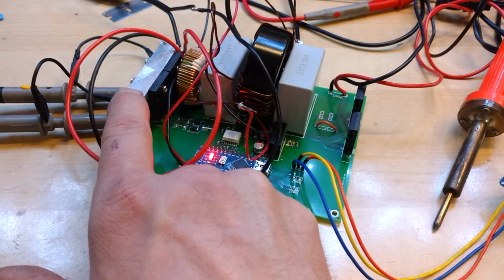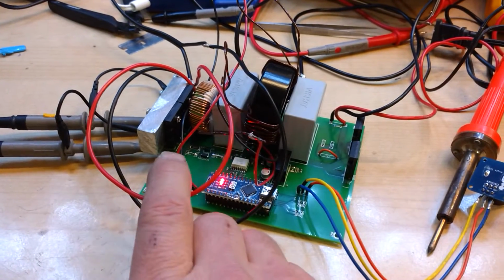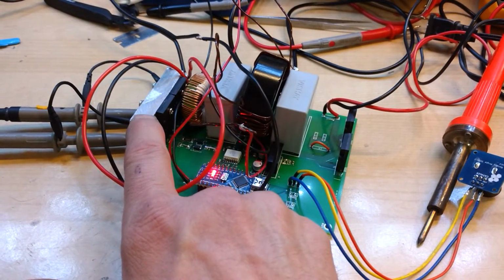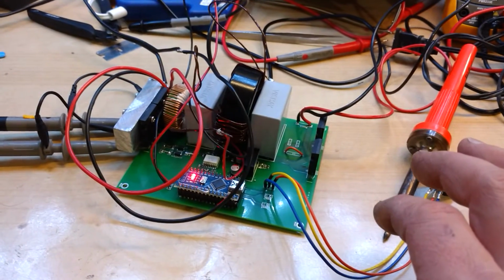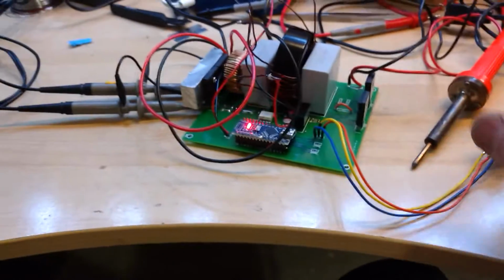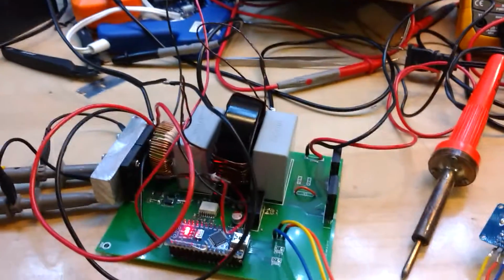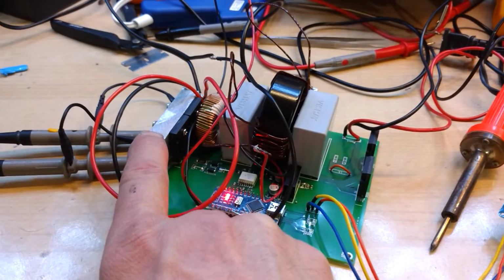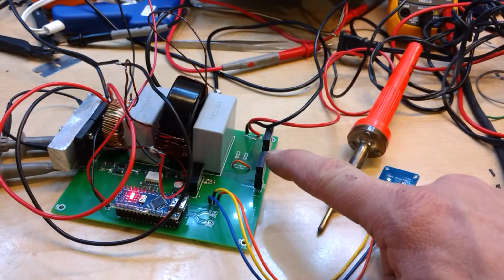And what that enables me to do is these are running parallel, and my next version of this charger will let me actually run 2 of these in parallel on the positive sine wave and 2 of these in parallel on the negative sine wave, and that'll rectify all the current and chop it up and put it into whatever I'm trying to charge. So that'll depend on the turns ratio of my inductor. So for instance, to hook this up to 220 or 240 volt AC, you would wind this accordingly so that the output could charge, say, a 400 volt battery, and that's where I'm going with this.